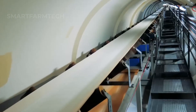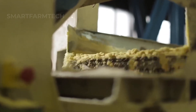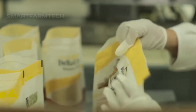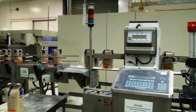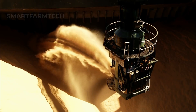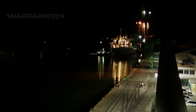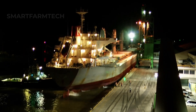Finally, the sugar crystals are dried in a large rotary dryer, using warm air to remove excess moisture. The sugar is then conditioned and dehumidified in a 3,000-ton conditioning silo, where it rests for 24 to 36 hours before packaging and distribution. The factory's high-tech sugar-making process is mind-blowing. What part of this sweet process amazes you the most? Let us know in the comments.